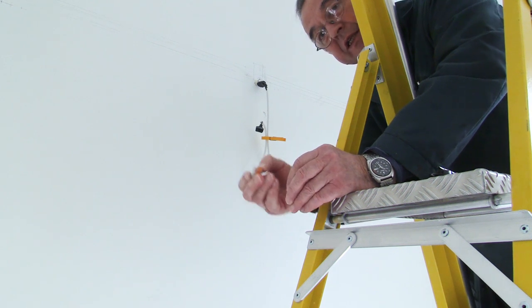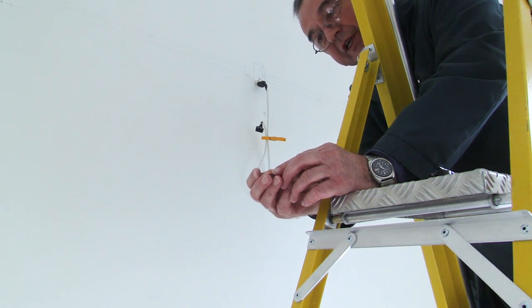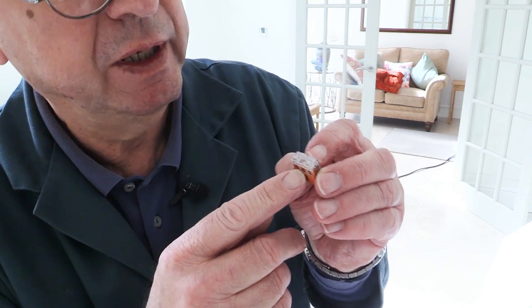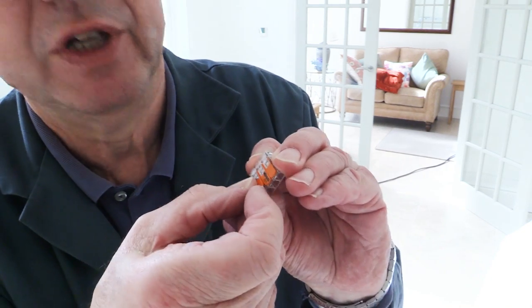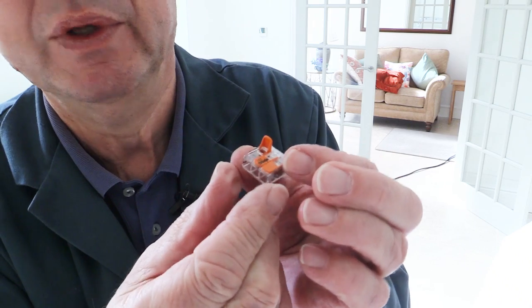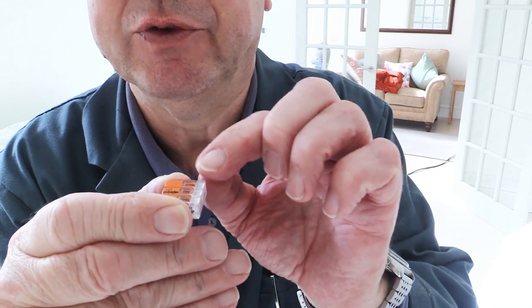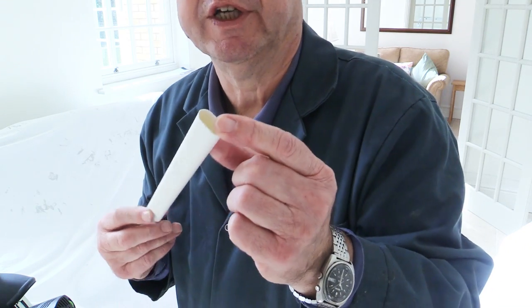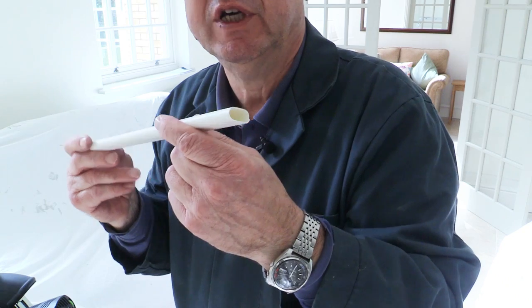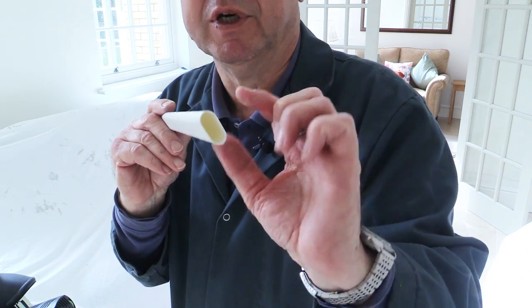Tom the electrician has been very helpful and let me have this little cable clip — he gets them from Screwfix. This one is for joining three wires together, so it might be three earth wires, three neutrals, or whatever. They've got little levers, and if you raise the lever up you can put a piece of wire in and then clamp it down — that wire is fixed with really no fuss whatsoever. They're made by a company called Wago. He also gave me a couple of offcuts of conduit which he wants the wire to go in, so I'm making my channels large enough to take this and allow for mortar and plaster on top.